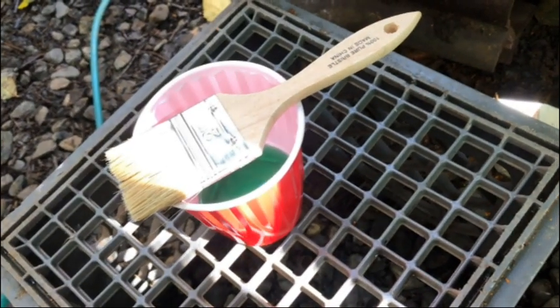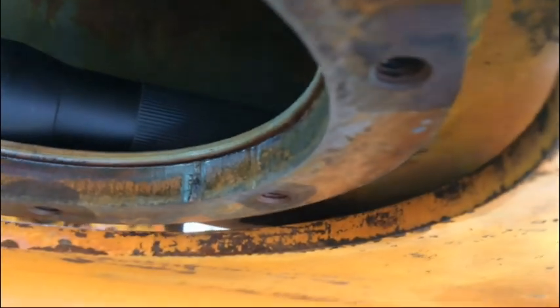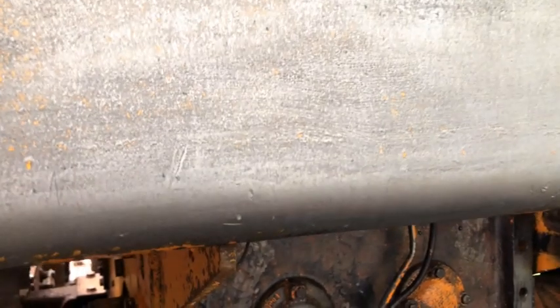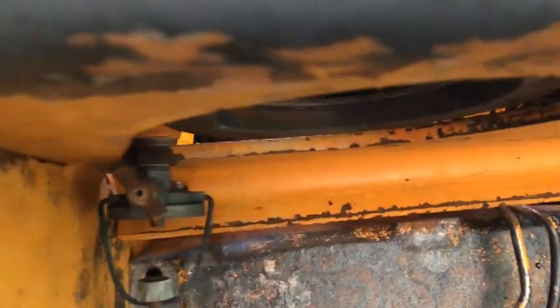So I'm going to go ahead and finish painting that Ospho on the other side, let it dry overnight, and then we'll figure out how to treat the inside of that tank so we can hopefully get it to stop leaking. So we let the tank dry a couple days after applying a coat of Ospho. Now the Ospho had just a little bit of a light dust in there where it was working over those pitted areas, and the pitted areas had some black residue.